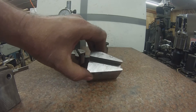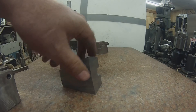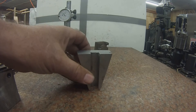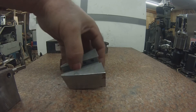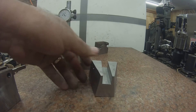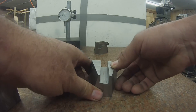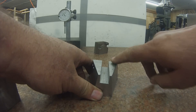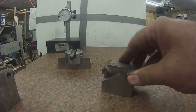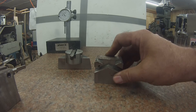This is an Acme threading tool — same thing. You cut this side to get this angle, then you flip it over and cut this side to get the other side. You can't very well get the front — you have to do something different; there's not enough surface. If you notice on the bottom, it's not flat. If you clamp it this way, it gives you a little rake angle on this side of the cutter, and then you turn the magnet off, put it this way, it gives you a little bit of rake on the other side. This one is for 55-degree English threads, which I made up just to have on hand but never used again.